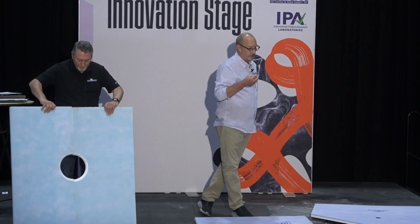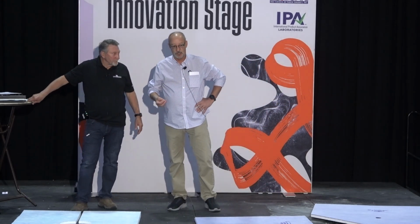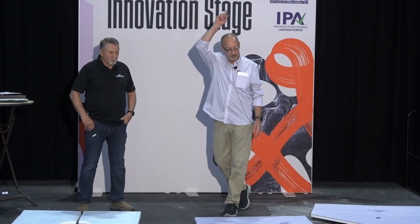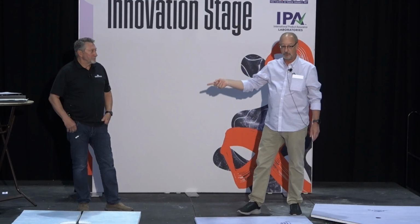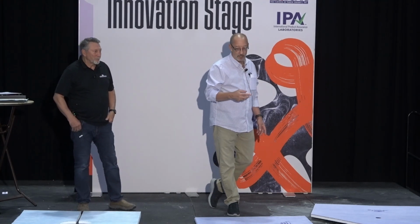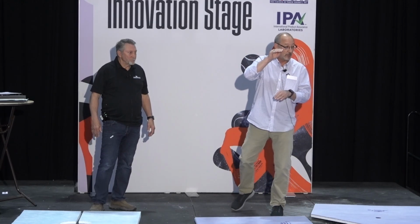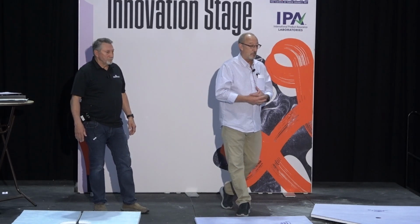Speaking of that, there's a huge market for these in the commercial industry. We've done several hotels where the showers are a size or two. We can custom make this base, whatever size you want, put the drain any place you want it. Getting this up 32 stories is a whole lot easier than getting sand and cement up 32 stories, especially after we just got out of COVID, when man elevators were limited to about 6 people on the man lift, not counting wheelbarrows. So this is a huge time saver on commercial jobs. Even though the price of the product itself is more than your typical dry pack mortar mix, the labor involved and the transitioning time and the ease of the installation usually will more than make up for it.